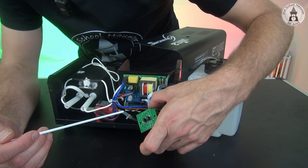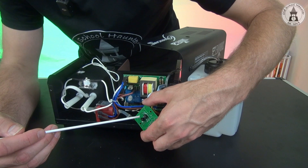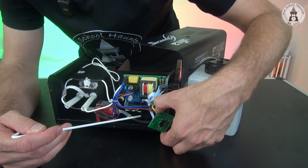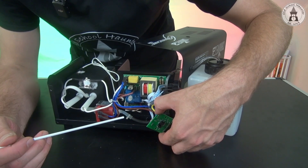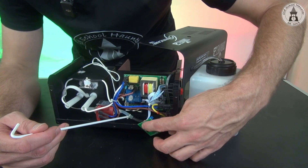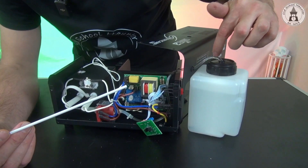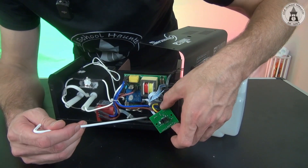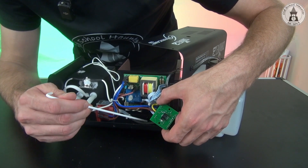But in my case it was a little bit different. As I opened the case and removed the sensor, I saw that there was some humidity in between the sensor and the tube down here. I don't know where it came from — maybe it's some condensation water or maybe some fog fluid. I checked this connection and everything is okay. The only thing I can imagine is that during a refill process, some fog fluid flows over and then flows down this tube and collects at the deepest point down here in between the sensor and the tube.